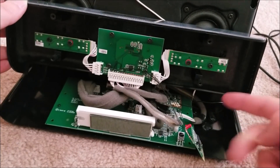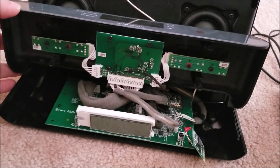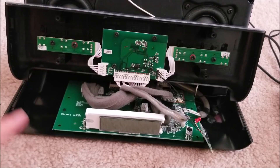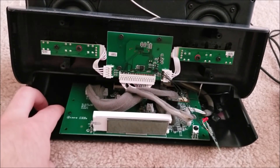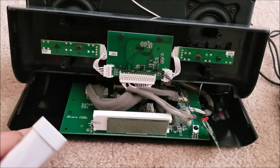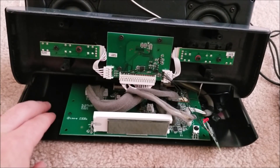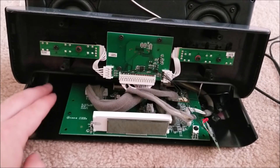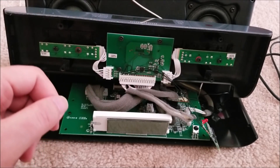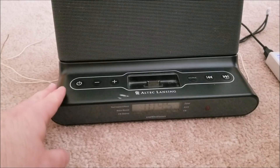The original antenna wire was cut - someone cut the wire off - so I had to go in and solder a long piece of wire. I'll probably tidy that up and put a dipole antenna on the back once I get hold of one. In a future video I'm going to add one of these tiny little battery banks - take it apart and fit it somewhere inside - fit a small lithium polymer pack, some charging circuitry, and wire it to a USB port or the original DC barrel jack, making this a fully standalone Bluetooth radio with auxiliary input.